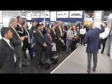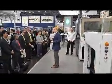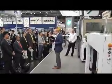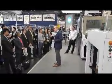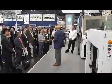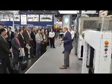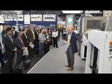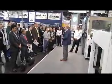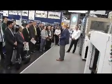The next process is that the drum rotates slowly 3 times, which again takes just a few minutes. And this UV cures the crease lines and makes them tough and hard. So you can do up to 10,000 impressions just on one of those foils. The operator is going to load in information about which substrate you're using, simple, or just recall previous information. Going to load the card into there, and then that is it. You're ready to run. So it's completely different from any process you've seen before.